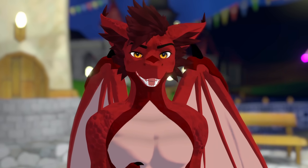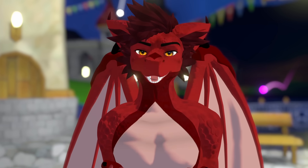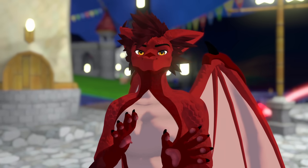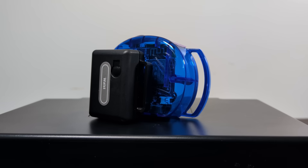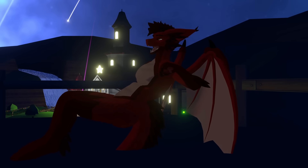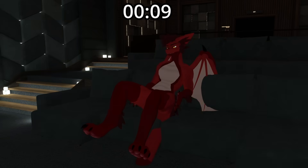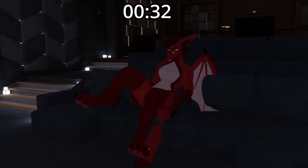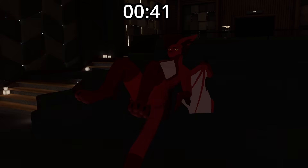That just leaves drift and how it's handled, and this is where ReboCap falls behind. It gives you three operating modes. First is six-axis mode, which is what most SlimeVR-compatible trackers run — but most of those are also running better IMUs. With it on, sitting completely still you won't drift that much, but as soon as I start moving my legs, in 47 seconds I get the amount of drift I would get in like 47 minutes on other trackers.